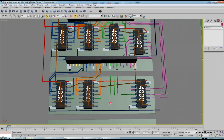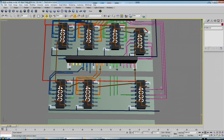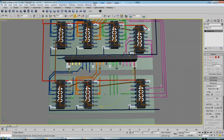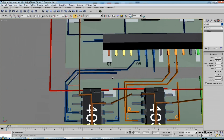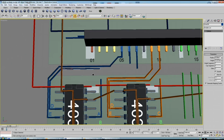And I will have to make this secondary board with these 3 chips. And why not 4? Because I only need 3 gates per chip, and the last digit will borrow 1 gate from each of these 3 chips on the bottom, and will make another digit pretty much. So it's a bit weird, but here is how I am building, dragging and fitting everything.